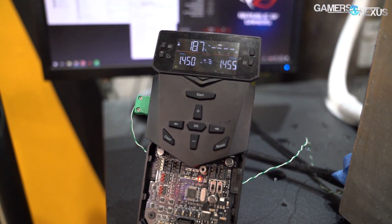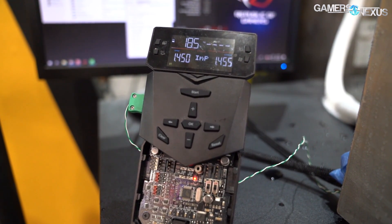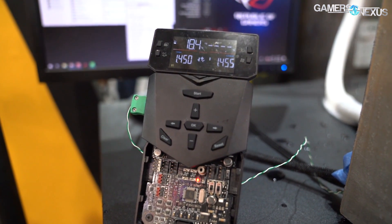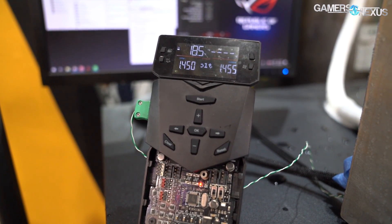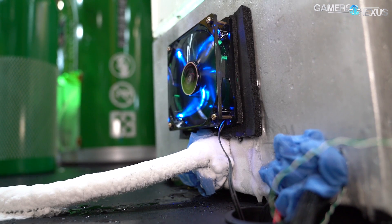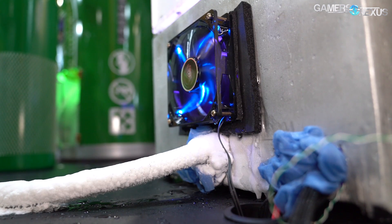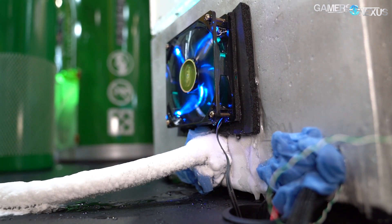For one day of cooling, you end up with this box sustained at — well, it's currently at minus 25, but in Roman's video it was much lower than that. The intake comes into the bottom box. The bottom box has a 5-millimeter thick aluminum wall on all sides. Inside of that box — you can't see it in footage — but there's another box, and the LN2 transfers into that inner box, evaporates, and comes up to cool the system.